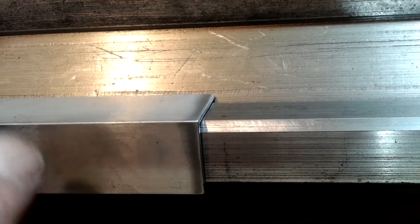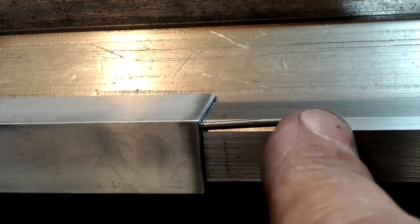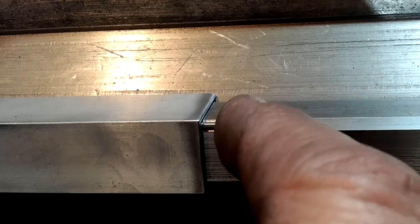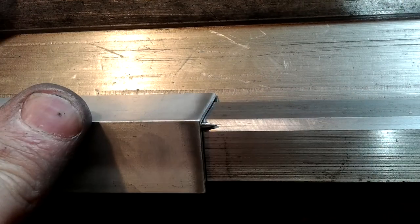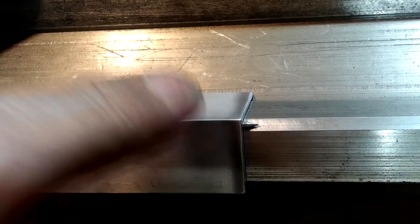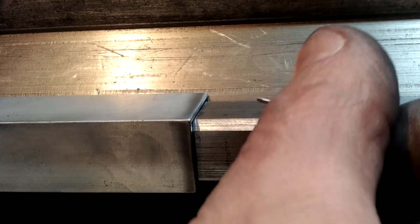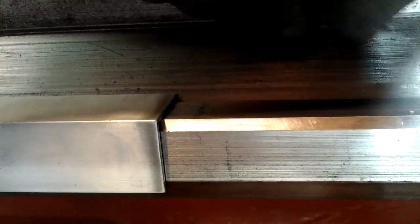This is a view of the aluminium angle on one of the V-slides. And you can see one of the DIY rollers trapped under it. Because you can see that it has some drag on the roller, that indicates the angle plate is very lightly held off the slide. And it should provide excess material over the slideway when the epoxy is set.